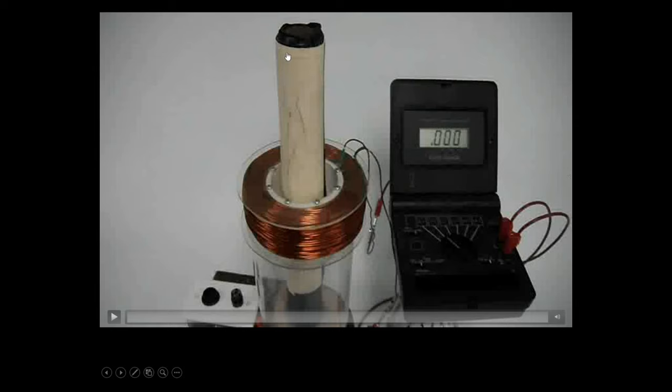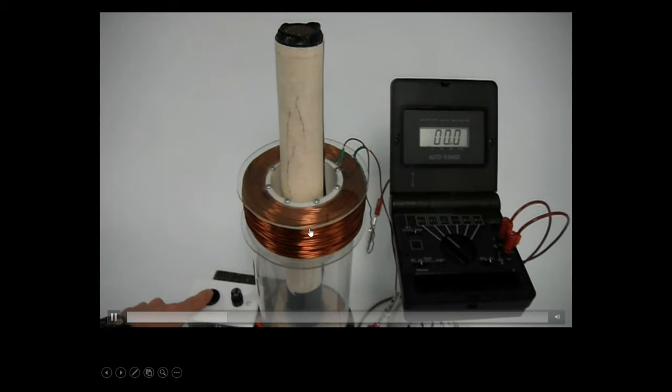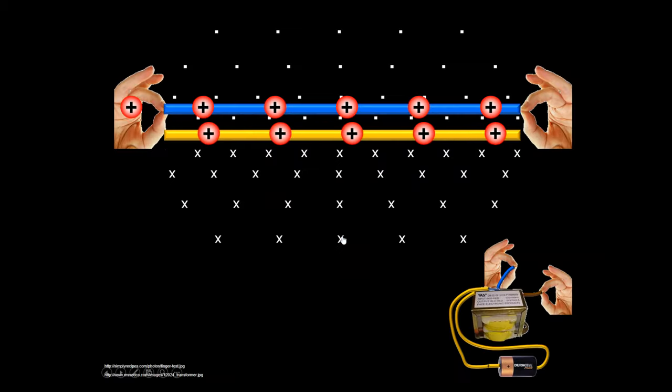And same thing here. That's back to that one that made the light bulb turn on. That had alternating current that went back and forth like this. And then this coil was wrapped as well. And when you push the button, it induces a voltage onto that coil because there is a changing magnetic field that's putting force on those charges. And you absolutely need a changing magnetic field to create motion in these charges.